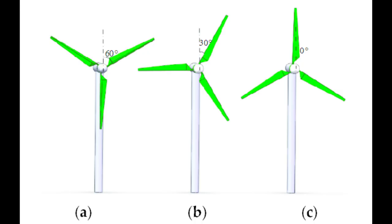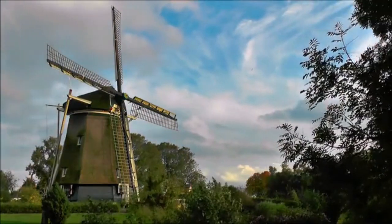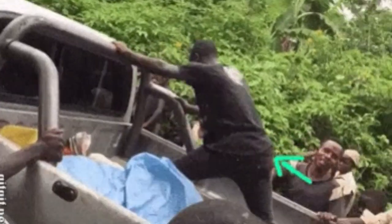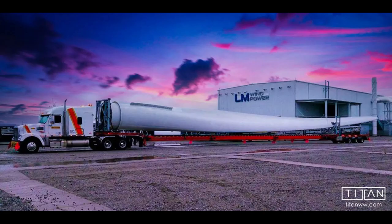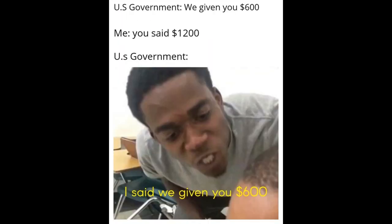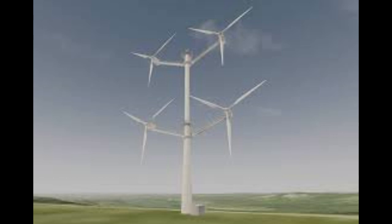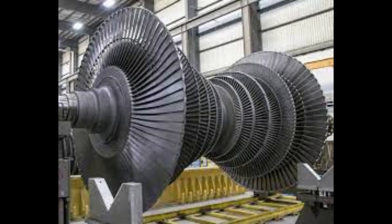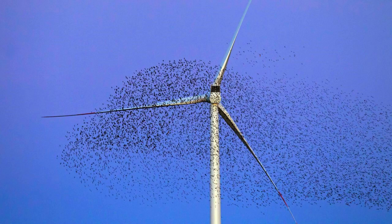In other aspects, three blades have a smaller resting inertia compared to four blades. Four blades make it easier to find a balance point, which means the turbine has a harder time moving from rest. There's also the cost — more blades means more material and more work to assemble. So if you want to capture as much wind as possible, going for the maximum number of blades is the way to go. But efficiency here is about how much energy can be harvested with as little loss as possible — and for efficiency per blade, three is the way to go.